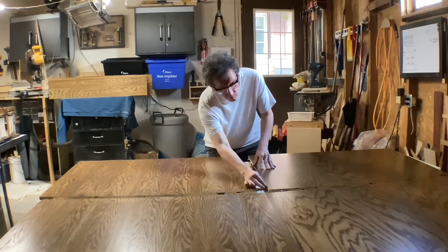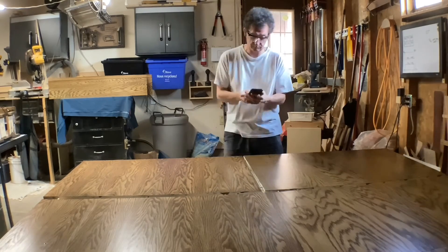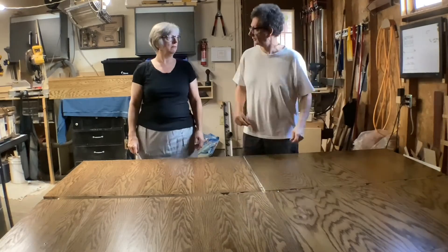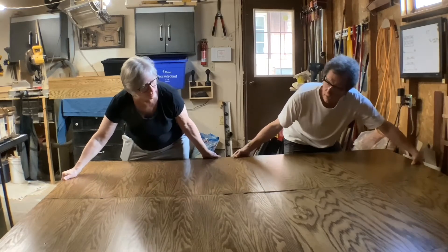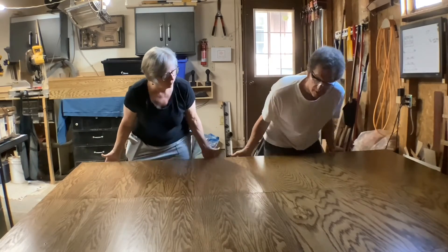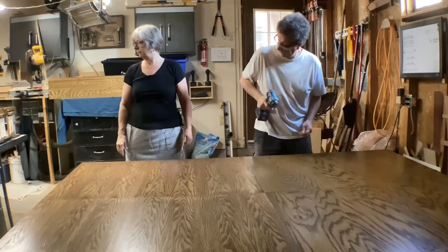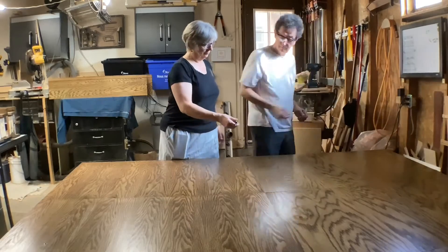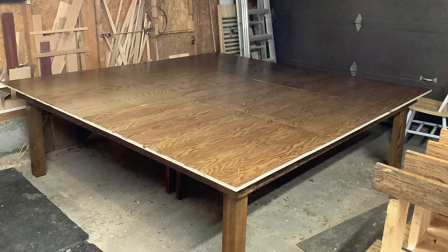Next, move on to the left side panel — left front and left back. This is really a two-person operation, so contact someone willing to help. Put the dowels in the center, push the panels together toward each other, and then push those panels towards the center — that secures them. You have to do one edge before the other. As always, put the screws into the outer edge, but don't use a drill. Then do the left and right panels in the same way.